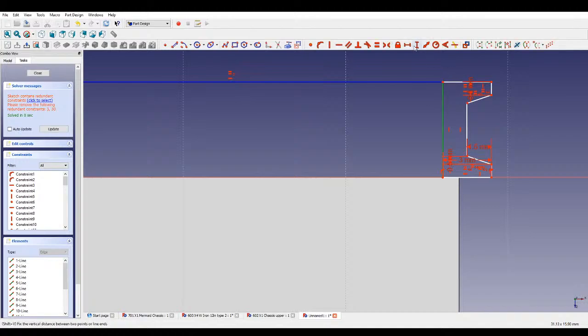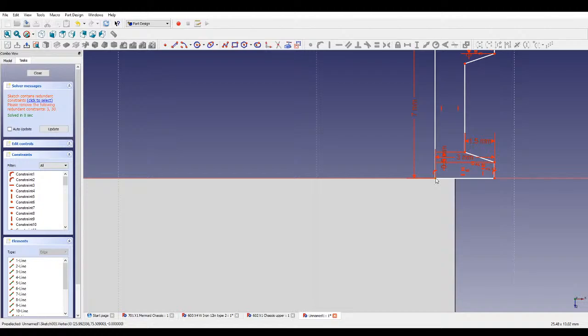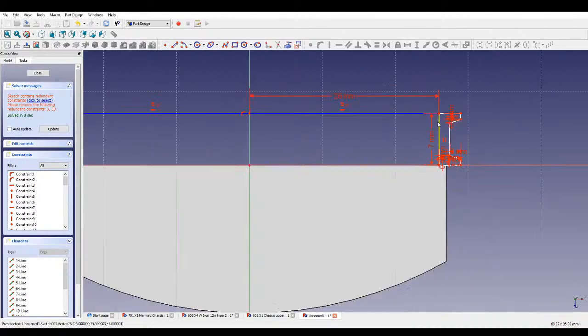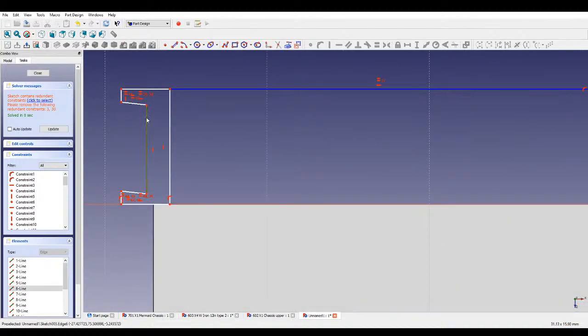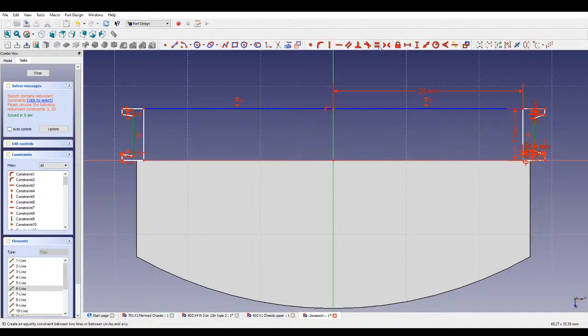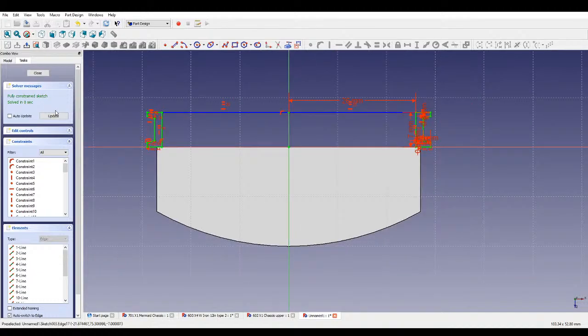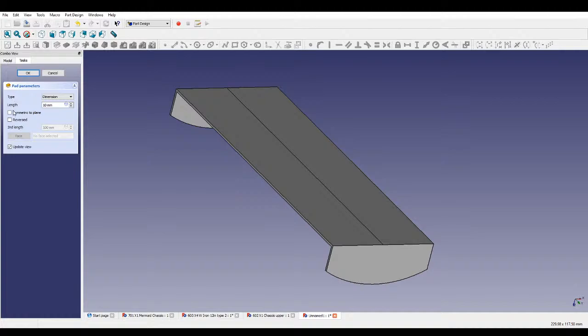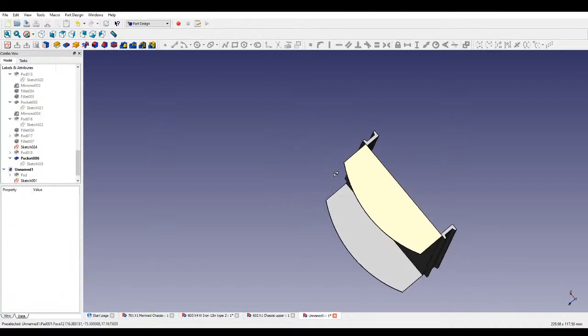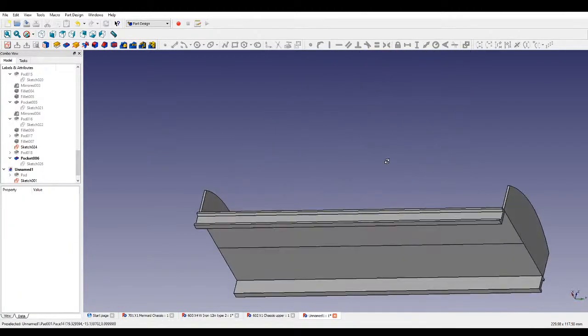Right, I said these were 1 foot channel for convenience. 26. Why is it? Right, there we go. Okay, now these run full length, so 151. So they're slightly heavier than they need to be, but just to give it more stiffness, as there is nothing to this.